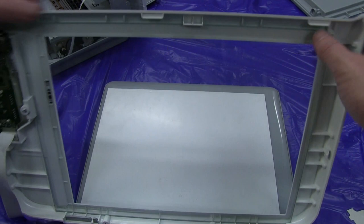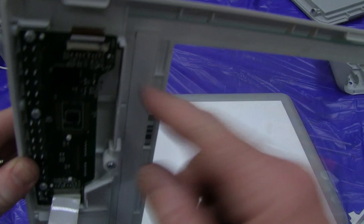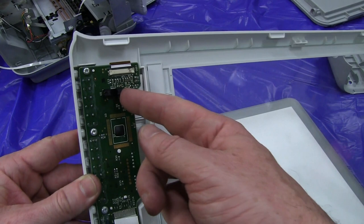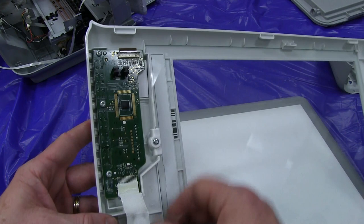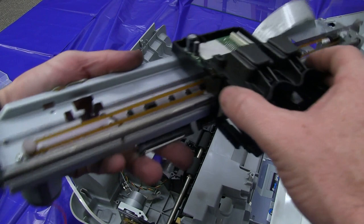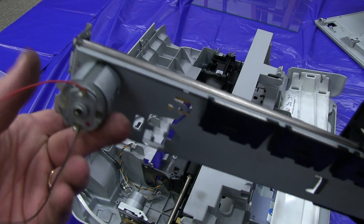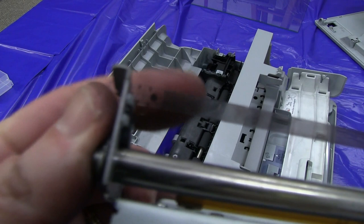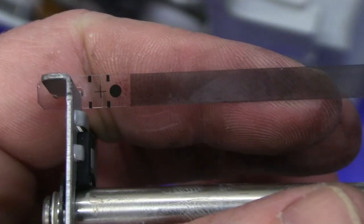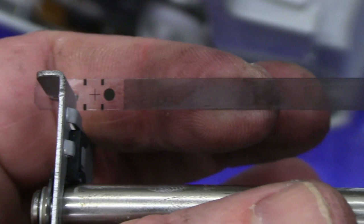The board over here is where our LCD is. We can get the LCD module out of the back of that. We've just got ourselves some flat flex in there. Apart from that there's another photo sensor there, but it's just got chip on board — no good. So that board's not worth salvaging apart from the LCD under there. If you had a use for the mechanism here for the print head, you would certainly keep it. There's just a basic DC motor on the bottom. And you can see how they get the feedback on that thing — you'll probably have to watch this in HD to get that. You can see they've got a tiny little stripe pattern in there of a known distance.